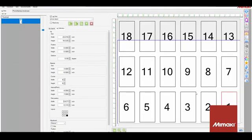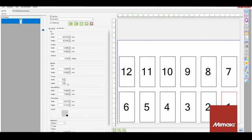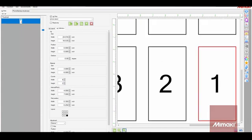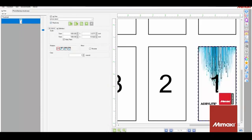So in order to keep 1 inch spacing, I'll enter 4 by 7. As you see, the size changes have pushed the print off of our print area, so I'll reduce the rows and columns under counts. I'm only going to have 2 rows with 6 parts per row. Since we don't have more space for parts, I'm going to offset them off the origin a bit. The origin is here at the bottom right corner. We will still have jig space beyond the print area, but this will make it a little easier to align. And I forgot to center align the image placement, so I'll do that now before returning to image layout. I'll also mark it read-only to indicate to myself that this is done.